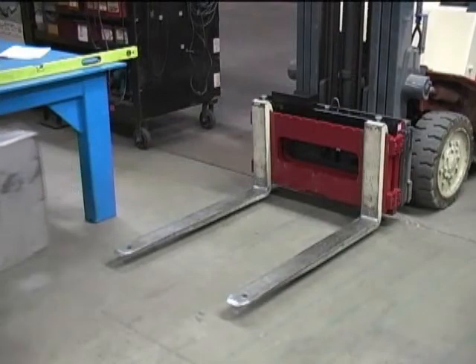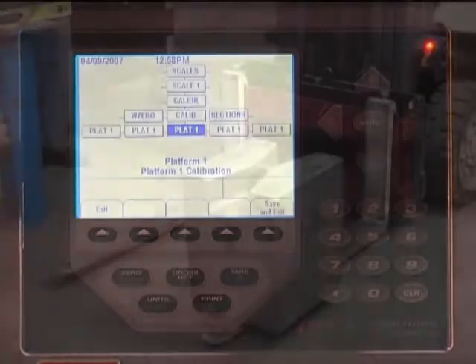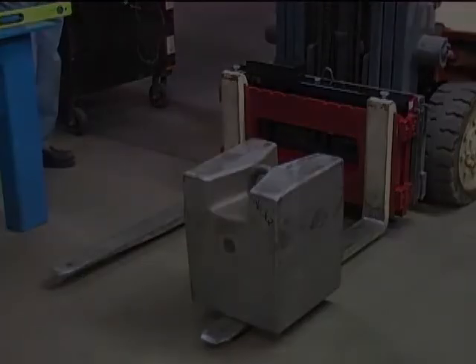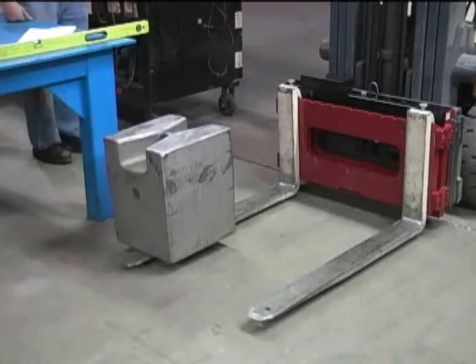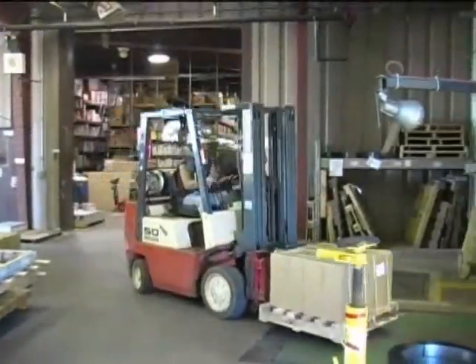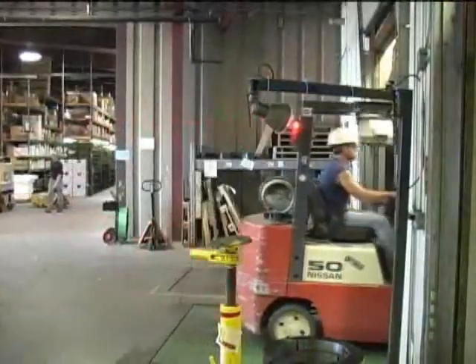The calibration will finalize. When done, press the Save and Exit soft key. Calibration can be verified by placing the test weight on either tine — the readings must be the same. Once configuration of the user's parameters are all entered, the CLS should be ready for daily operation.